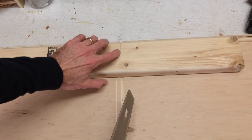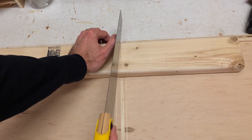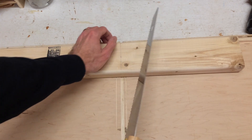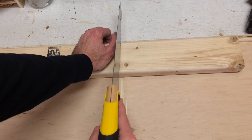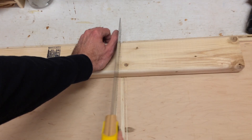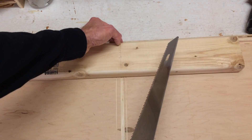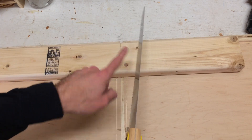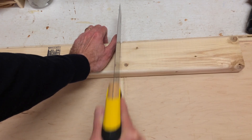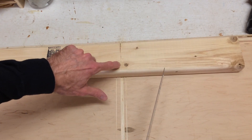To cut to a clean line, use your thumb resting just above the surface of the material to guide the saw — a bit like playing pool. Stay away from the teeth. Put it where you want it, guide it backwards, and pull it back a few times to start a groove exactly where you want it. You don't need to force the saw — just get a groove there, and that gives you a channel to start sawing. The saw cuts on the push, so get in the groove and start pushing. Make sure your cut line is staying on the correct side of that pencil line.